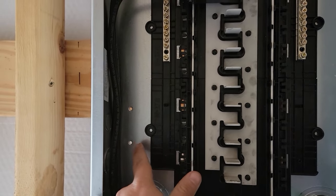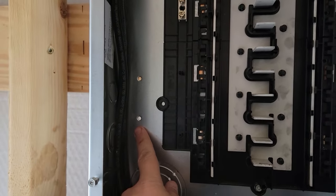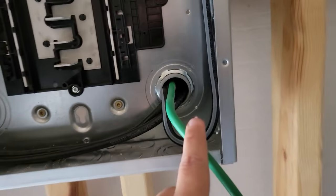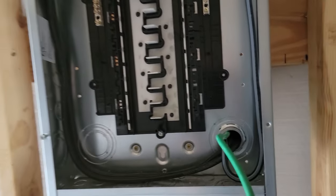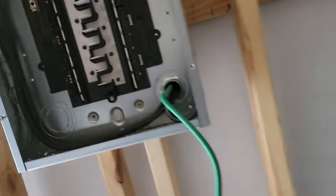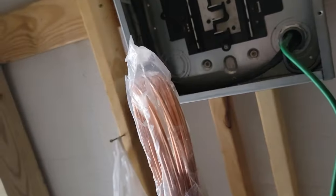And for this box, it's an Eaton, and it has to match. This is a BR up here, so it has to match this box. A CH or a BR, I do believe will work, but I'm looking for just a BR bus bar, ground bar. And I'm going to run this over to that. And because this is a separate structure, this will run back to the main panel. I'll have to run at least a number 8 gauge right here. I have to run this 8-gauge copper wire